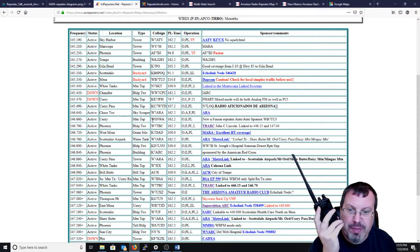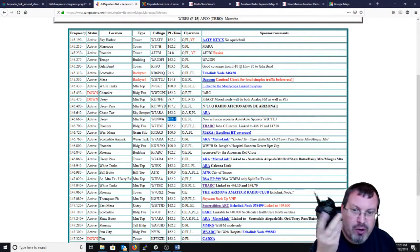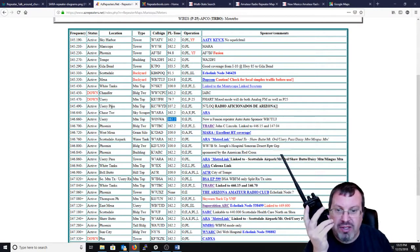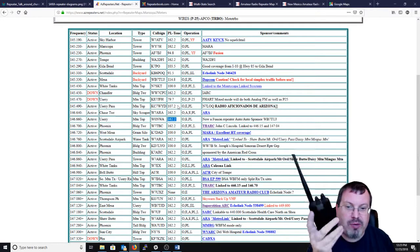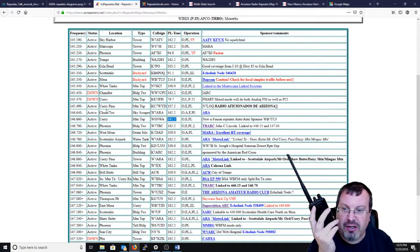All right, now most of these other ones, like if I was to go to this one right here, this 146.660 up on Usery Pass, which is a Fusion repeater, has a 162.2 PL tone. And I'll show you how to program that in there as well, but I want to go with the other one because my radio automatically usually picks up the 162.2. I just want to be able to show you how to change it, all right?